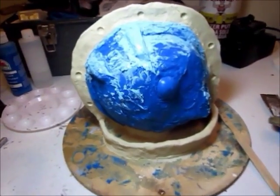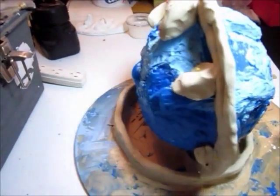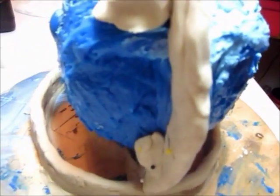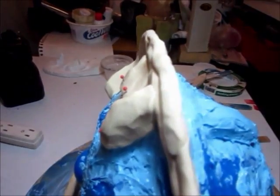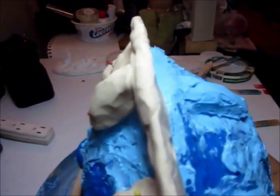So we've got the rest of the wall constructed and kind of sealed down a little bit. And as you can see on this side, those are the supports. Bring the light over here so you can see. I've got clay supporting up here, and then I have straight pins going into the silicone to kind of try and help stabilize that a little bit. And really all we need from this is to keep this wall steady while we're putting plaster on.